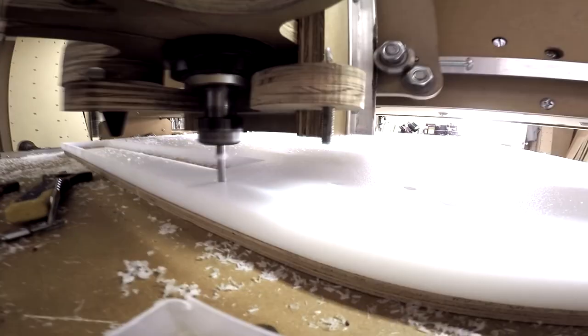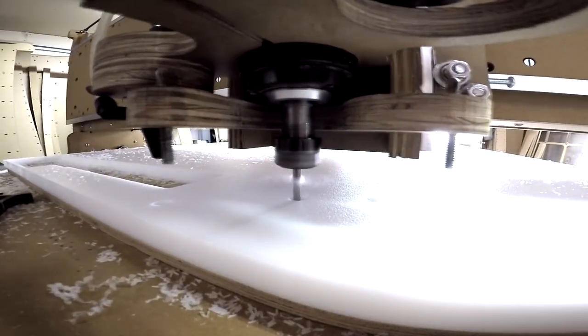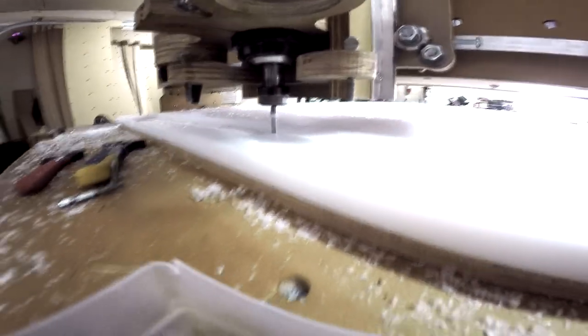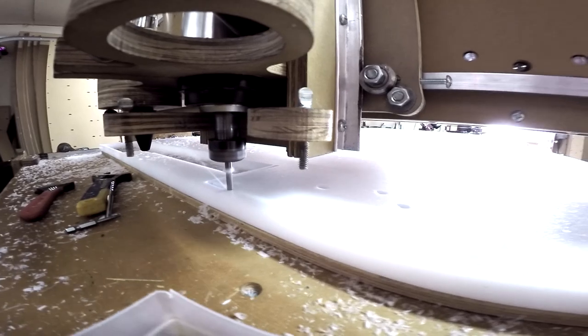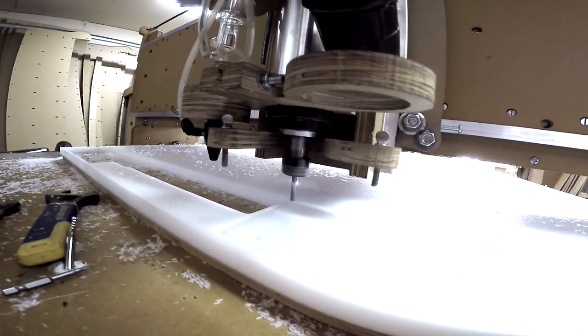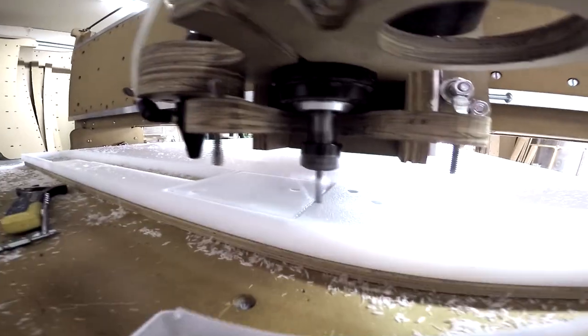I did. I think I went up to, I want to say 1/8 depth at the beginning. Okay, so in the beginning you did 1/8 of depth per pass. So per pass, yeah. It would take 7 passes to go through? Yeah, roughly, because we're going through 3/4 inch.